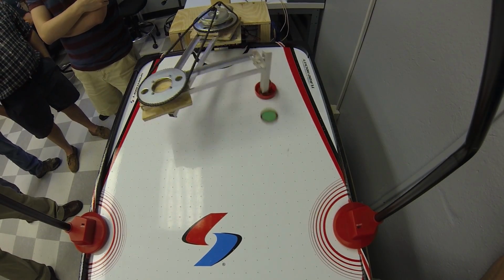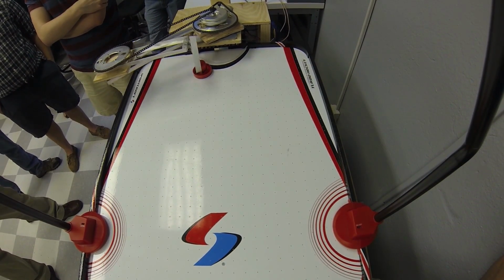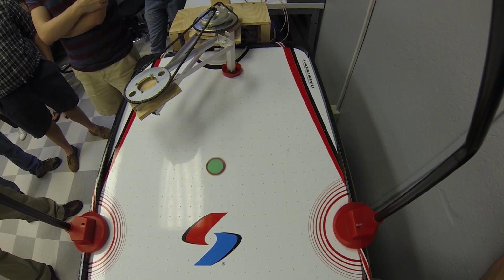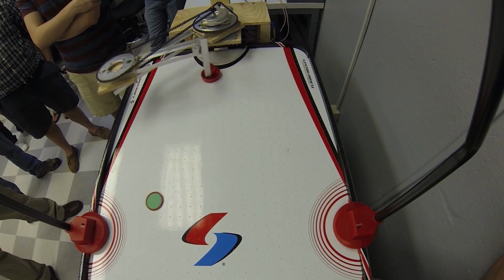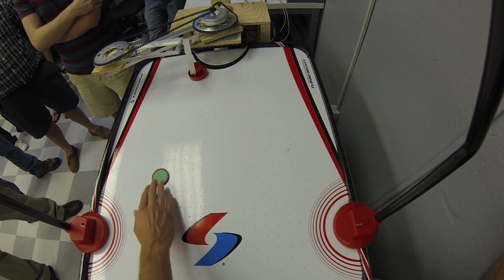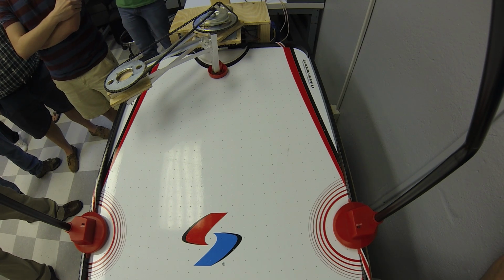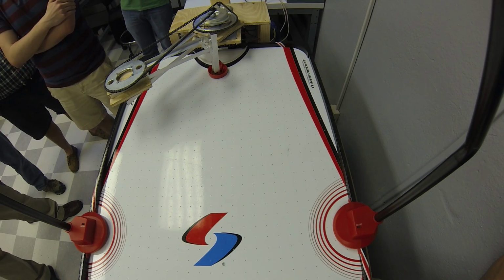To start our build process, we ran a simulation within MATLAB that would determine the optimal arm lengths for our robot. With this tool, we were able to have a much greater reach than any of the other teams while staying within the allowed table boundaries. Therefore, our robot was more similar to a human's arm because the lengths of the two arms were relatively the same. This allowed us to hit the puck with a lot greater speed because of the increase in angular torque.